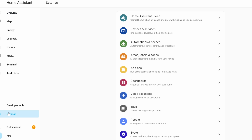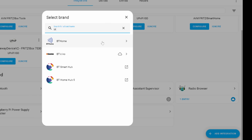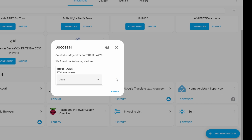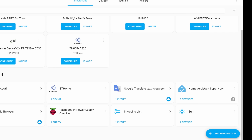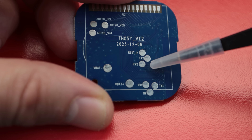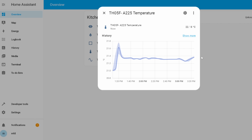For Home Assistant integration, go to Settings → Devices and Services, click Add Integration, type 'BTHome', and install it. Once installed it will start discovering the device. Click it, submit, and assign it to an area the usual way. You can then see the sensor values on your dashboard and use them as triggers for automations. There are also two UART ports you can use to trigger other devices — I'll link the documentation in the description.